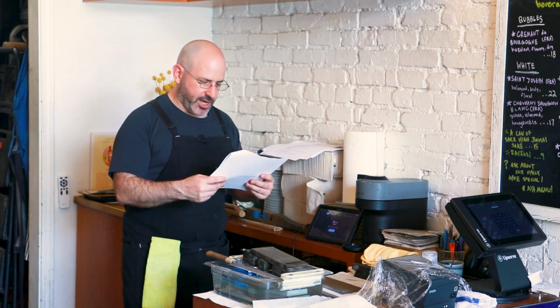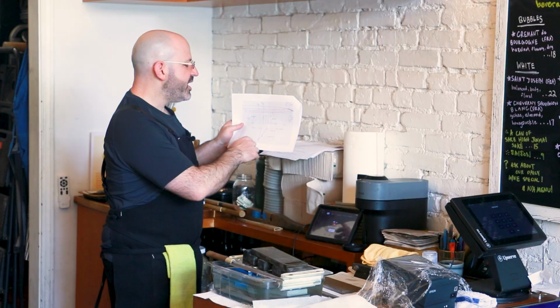Cool. All right, so on to page 8. Over time, your knife is going to shrink, and we want it to shrink in a very, very specific way. We want to make sure that whatever material we're removing from the edge gets removed here at the shinogi line as well. So if I take like a millimeter off the edge from a chip, my shinogi line has to go up 1 millimeter.